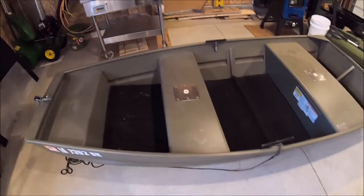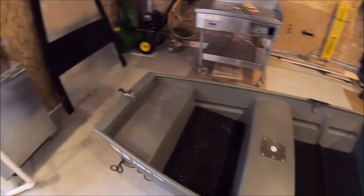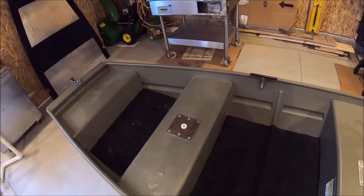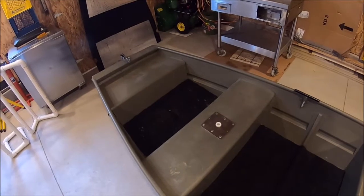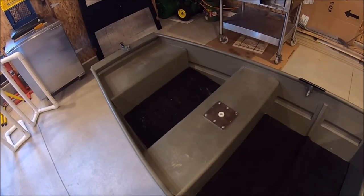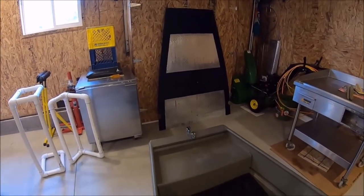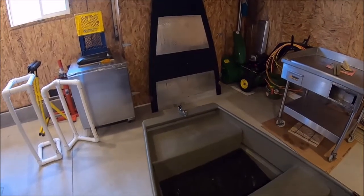And I finally bought a bow for bow fishing, and that's what I'm going to do with it. So I took that square plate, big rectangle is what it was, measured all my measurements and everything, marked center line of everything and the plate. Ended up using a Sawzall to cut that out. 4.5-inch grinder didn't like it, and the jigsaw didn't like it either. And I burned through 6 saw blades to make those curved cuts on the sides there. And it worked pretty good. It was the best tool that I had for the job.